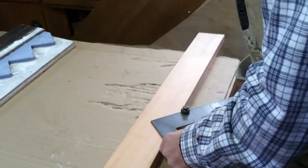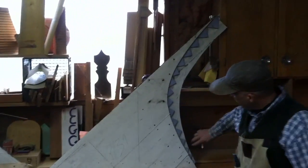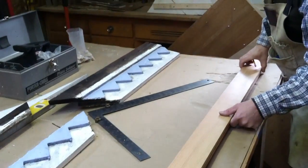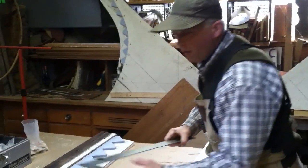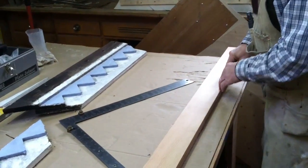Okay, so the next step in the process of making this historic fascia is, if you look behind me, you'll see this sawtooth component here, which I'm laying out in these 1/2-inch vertical grain fir pieces. I've got 2 of them that I'm going to mold together. I'm going to lay out the pieces using my framing square and square stops, and then we'll simply cut them out.